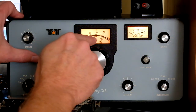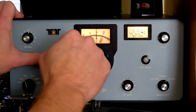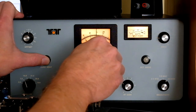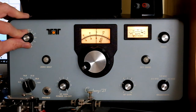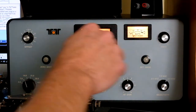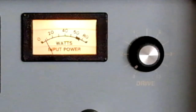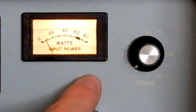Same issue zero-beating stations on this side — if I press that zero beat button, here he's high-pitched; now he's zero beat. I move my offset to where he's comfortable to listen to. Also, once you set your input power for drive on one band, reset it down to zero when you change bands — you've got to do the same thing again for each different band. This will be very different from band to band.